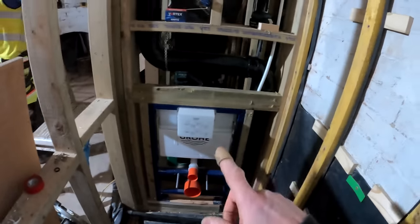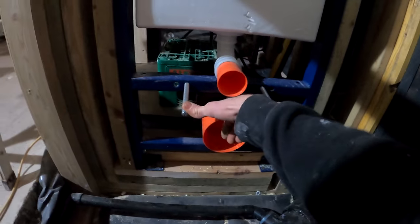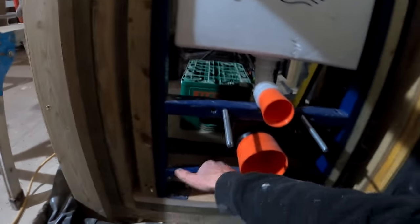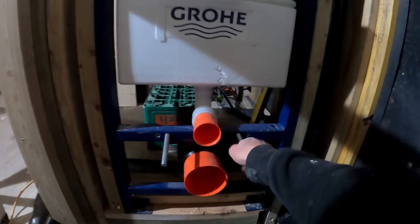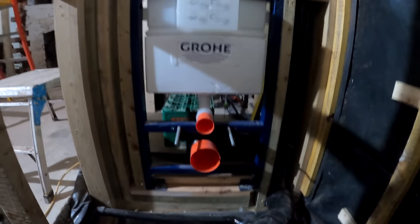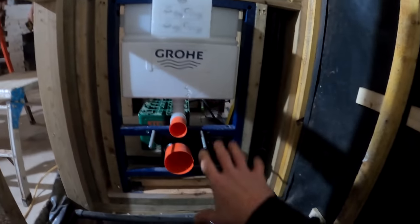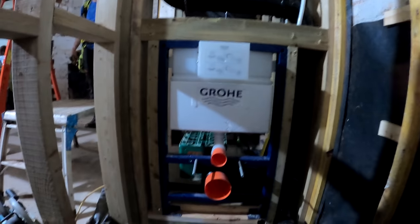So the framework is in for the ceiling. We just had a discussion and we believe there's going to need to be a light in here, so I'm going to leave the plasterboarding for now. I'm going to plasterboard this flat here, and then carry on where my plaster is, left up to this, and that can be rolled in nicely. Next, what I need to do is drop onto this wall. We need to ply this wall out - because it's a wall hung toilet, and the toilet pan sits flat against this framework, if you just put plasterboard over it, it can tend to flex a little bit and be a bit wobbly when you sit down. So what we do to remedy that is put some ply on - completely ply this wall - it makes it just that little bit more solid so it feels more robust when you sit on the toilet. What I'm going to do now is get cut around this flush plate, get cut around the bolt holes and the waste hole, get that all mapped onto this board, and then get it stuck in place.